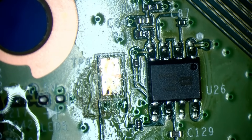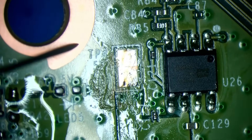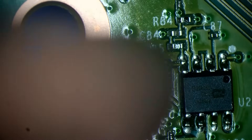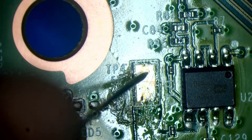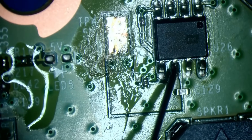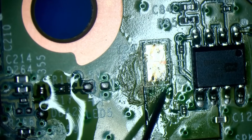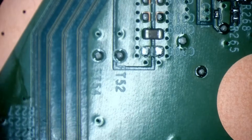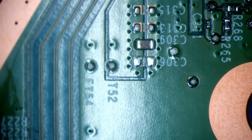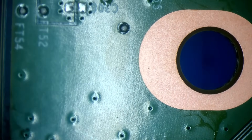Cleaning up that pad wasn't strictly necessary but fine. Now if we test this circuit — the 5-volt rail — we have connection to ground but no short. That's why I didn't just remove U26 immediately: even though that chip seemed like the culprit because the circuit runs through it, the vias go through to another layer of the board, and based on what we found, the fault ended up at C306. Testing around there now — no short, still connected to ground.